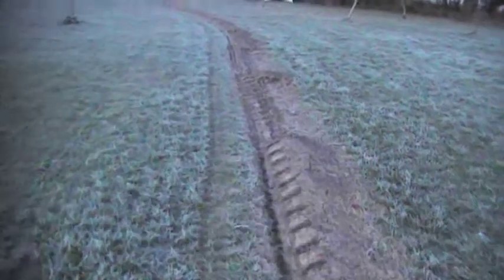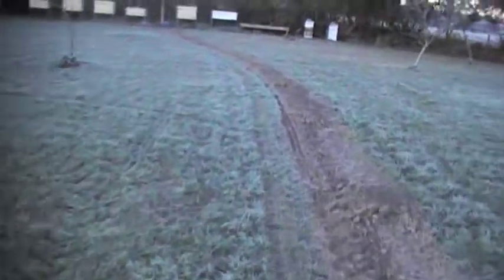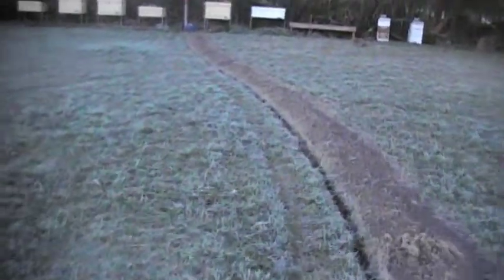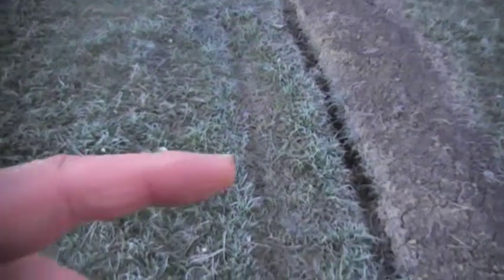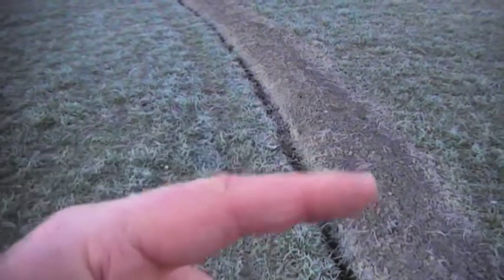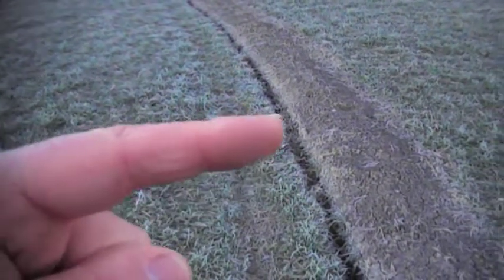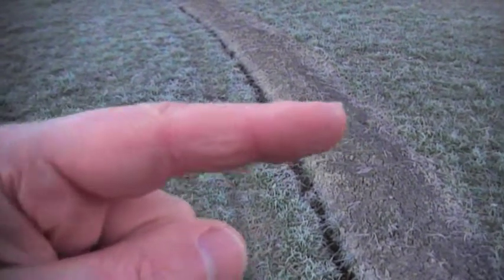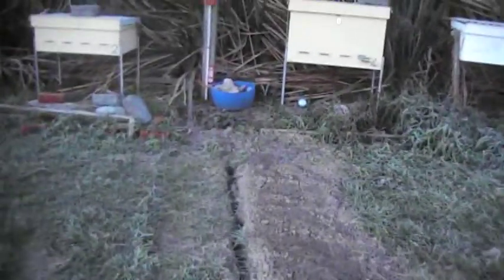It's taken me so long. There's about 120 meters of trenching that had to be done. I used a walk behind trencher, so you can see just here, you can see where the wheel track just cut into the grass a little bit, and there's one this side as well. And then there's like a worm that pulls the dirt that the chain digger digs up, and then there's a worm that moves it out to the right hand side. And it does about 30 meters an hour, so this took me just on 4 hours to do all this trenching. So it runs out here to the apiary,